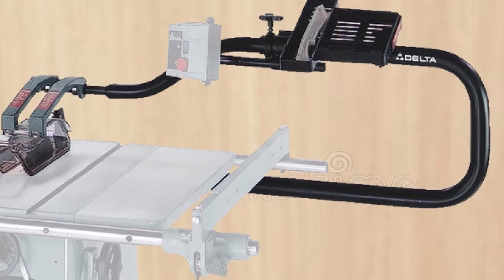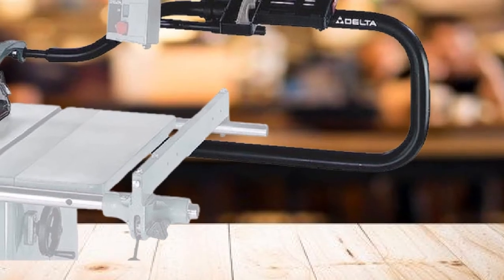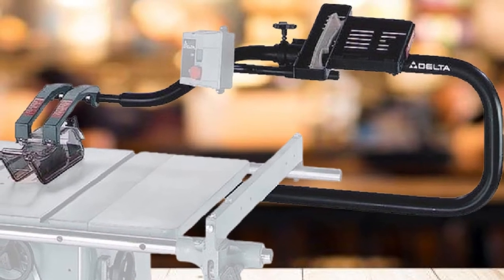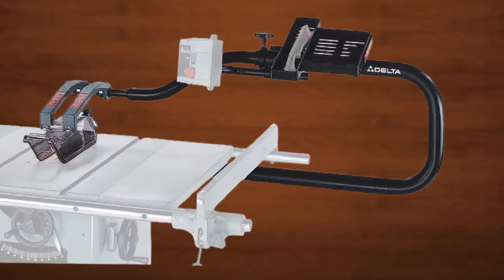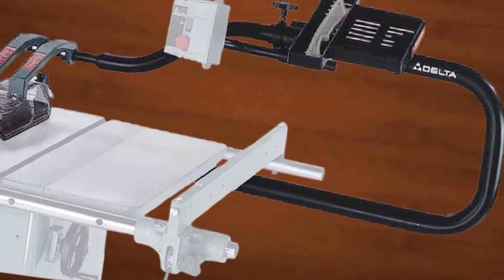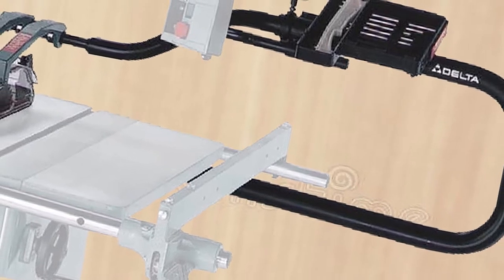The split basket shields are clear and transparent enough to allow better control, and the fixed splitter is great for maintaining perfect alignment with your saw blade at all times. Although it's possible to remove the guard whenever needed, you can keep it attached for extra safety during operations that require no cutting — you won't have to worry about accidentally damaging any wood pieces while reaching over. Besides the actual guard, you'll get a splitter, bracket support arm, and an extension, along with anti-kickback pawls for extra safety.